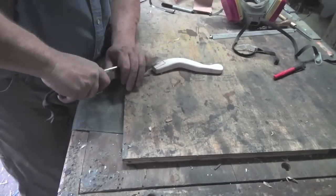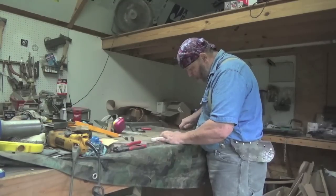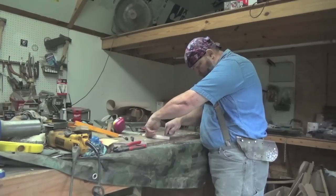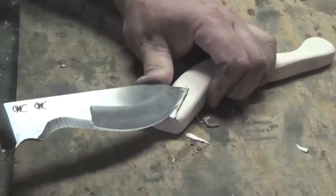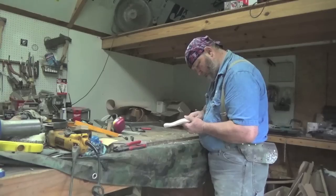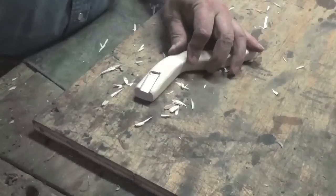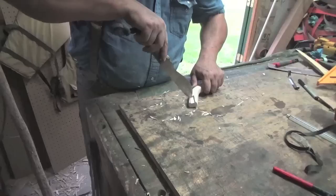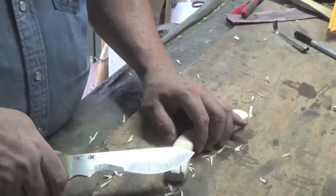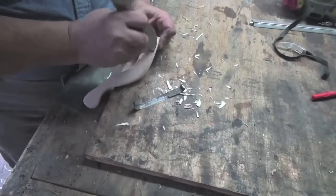And now I'm carving out the indentation for the blade on the crooked knife, and get that tip in there and work it to cut that cross grain material. The knife with that pointed tip, the revised tip, it actually works as a great carver. As you can see in these videos, it gets into those little nooks and crannies and gets that material out. The edge held up very well throughout this whole process. Of course, I'm using this knife here in CPM S35VN steel, so it's a very high quality steel. Even when I'm getting the tip in there, working out that recess for the blade angle, the knife worked great.